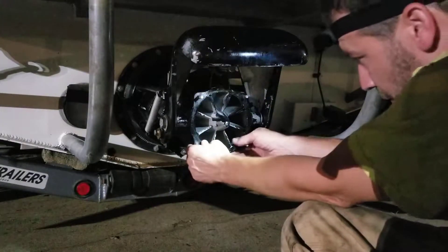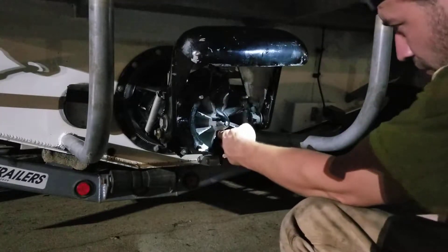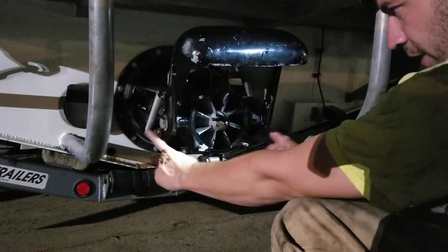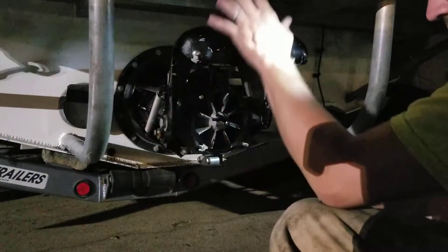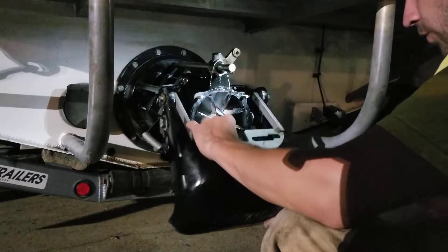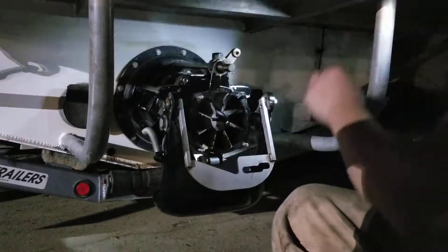Right after the sacrificial anode under here, this is the last stator in the stack, which I believe is a lot longer than all the others — it really gets that flow straightened out. The reverser and these two smaller bolts behind here are eccentrics that let you adjust the linkage, but the linkage doesn't work very well, the reverser bucket doesn't work very well. The whole thing's kind of a junky design I don't care for — that'll be one of our upcoming projects.